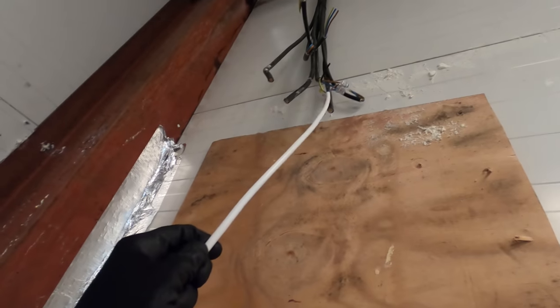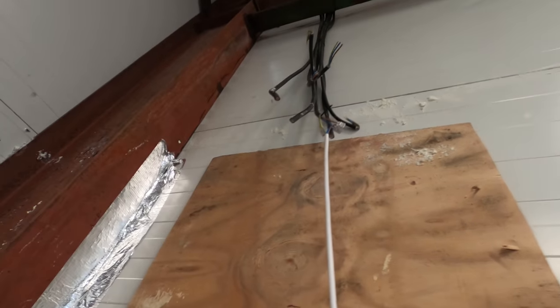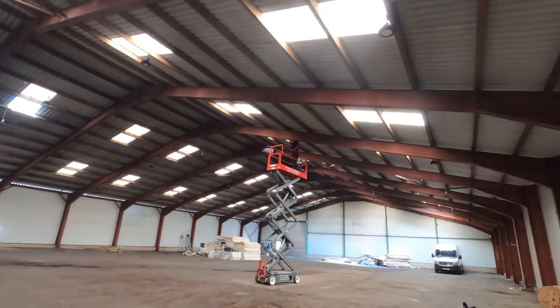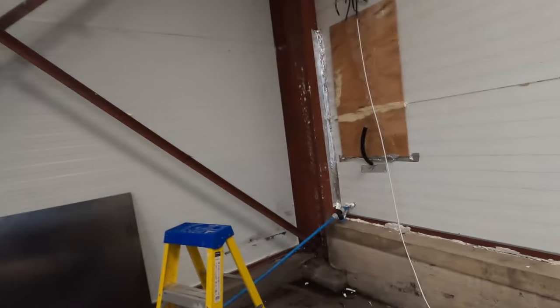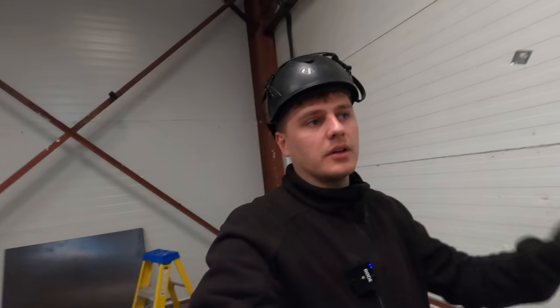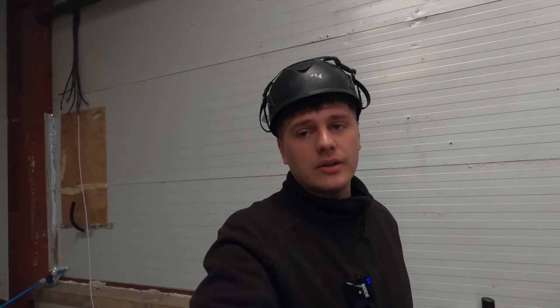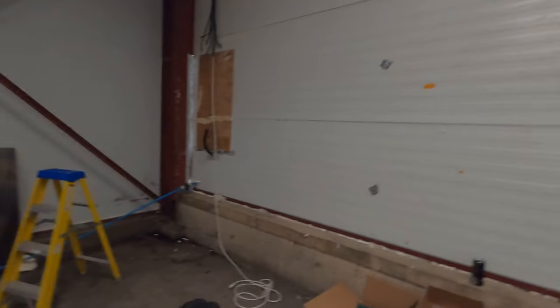So this plug top — we just used some ideal lever connections, very temporarily, bench-test style. We energised these lighting circuits through a generator and basically what happened was they come on in four sections. There are four lighting circuits — I believe the fifth one is probably the outside lighting circuit. There are 25 lights, so it's not an even spread divided by four, so they're in weird sort of bays. What's strange is the ones furthest away have the most lights on, which is probably not how I would have done it. But that's how we worked that out.